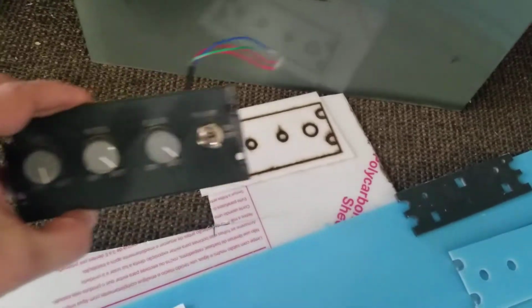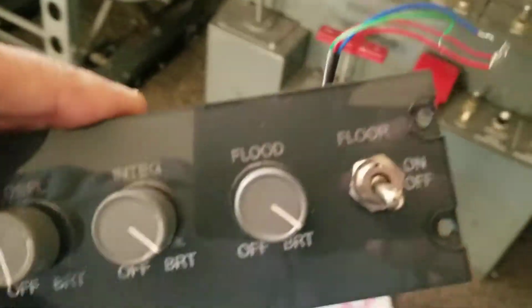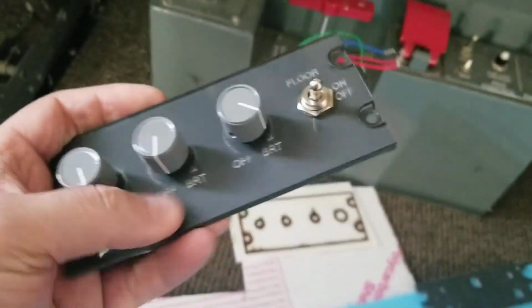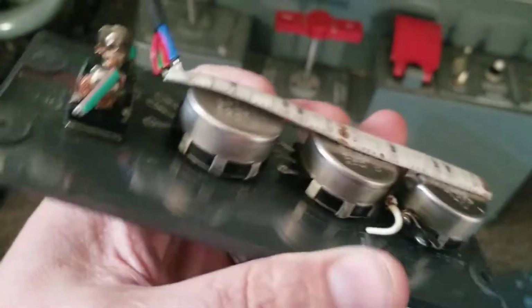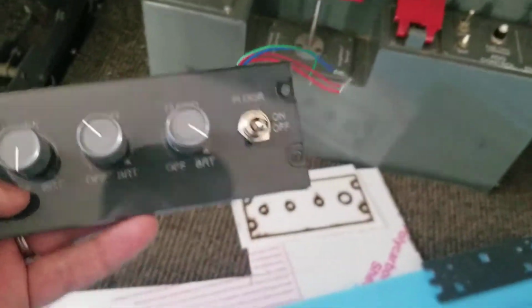The other thing I did was I went and just bought your traditional plexiglass, and I thought, well, if I painted that and then etched in the lettering, how would that look? And it looks actually pretty good when you hold up the lights and everything. You can see the back panel lighting. And I thought, well, that could work. What I did was I used the laser machine to do this in reverse. So the top of it is a really nice clear plexiglass, and it's painted on the inside there, and then it's etched in reverse. So you get this effect where it doesn't scrape off, and you've got a real nice protective panel, which I thought looked really good.